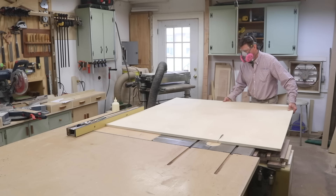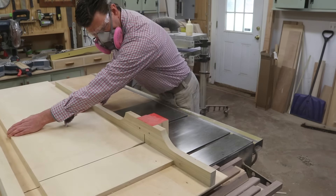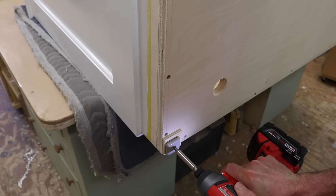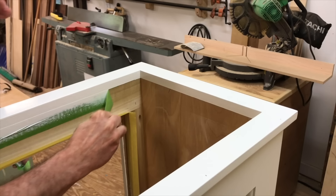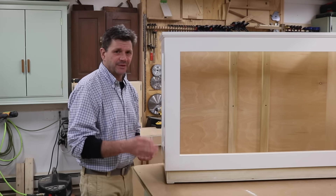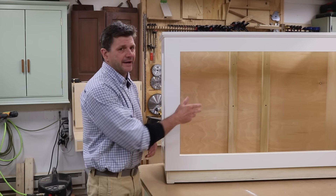For the top of the cabinet I'm using three-quarter inch birch plywood with walnut laminate over the plywood — click on the link in the description to see the detailed video where I make the walnut top. It's been a few days and I've now painted the cabinet. I also added some nylon dome feet to the bottom and some lifts to make it easy to move the cabinet and to allow the electrical cord to fit underneath. I finished the walnut baseboard and the top with a wipe-on varnish, and now I'm ready to finally put the cabinet together and install the lift.